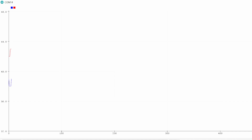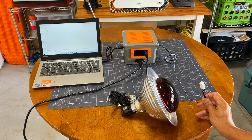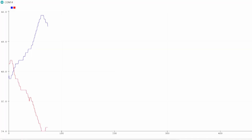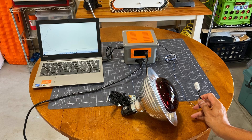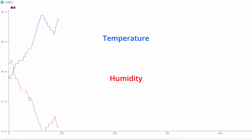As you can observe on this sped-up clip, as the temperature rises, the relative humidity decreases as they are inversely proportional. Once the temperature reaches 55 degrees Celsius, the lamp turns off. Then you see the temperature dip, and when it reaches 50, the lamp turns on. This process will continue, causing the temperature to maintain a certain range, which is suitable enough for this application.